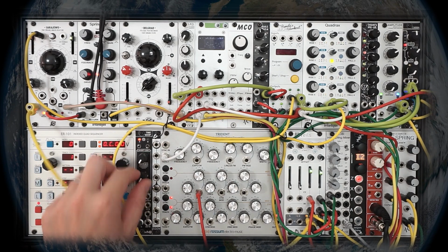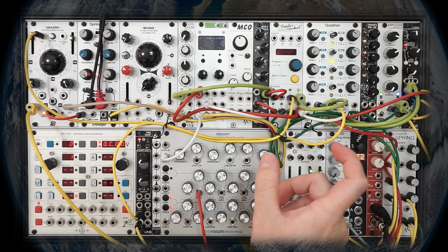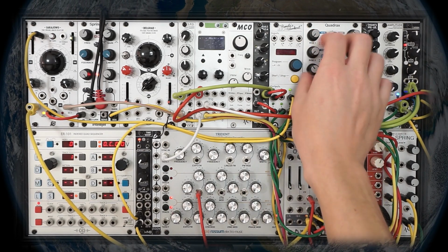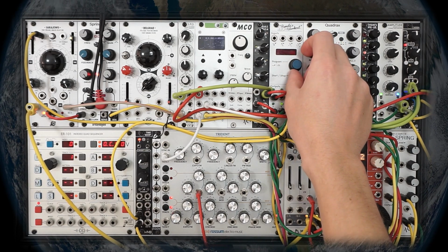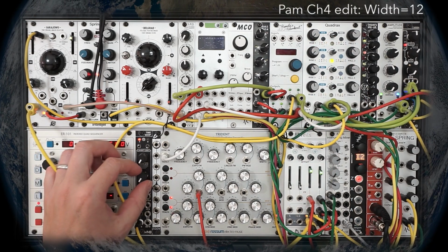The only thing is, since this is a 50% duty cycle pulse, we can't make the hold stage any shorter than that. So I'm going to shorten up the pulse a little bit. Go to our channel 4 menu. I'll turn the width from 50% and I'll start bringing it down. 40, 30, 20, 10. And I'll leave it at 12. Adjust the fall time on the slew limiter.